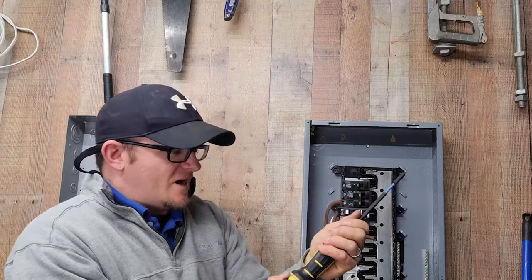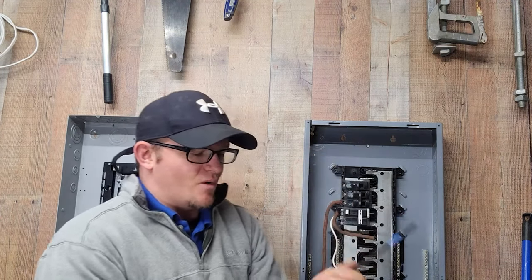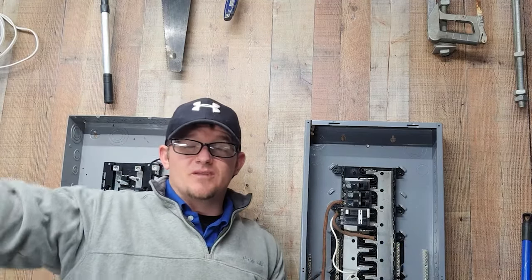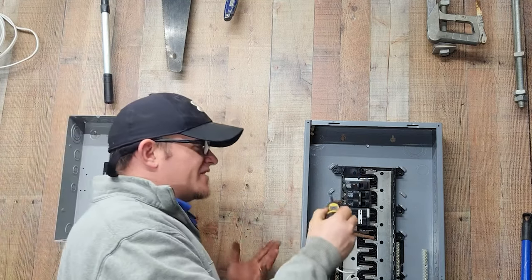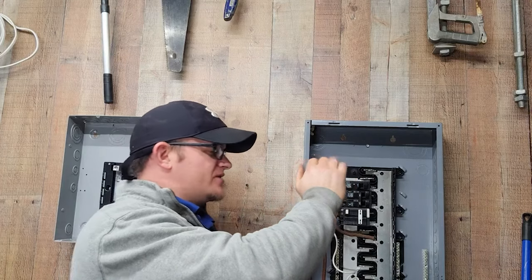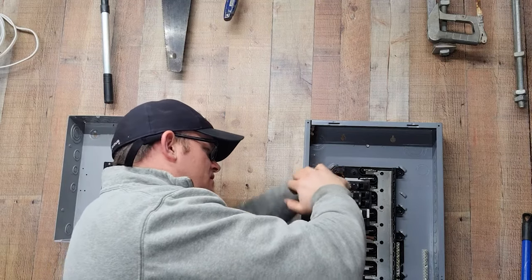Let's jump up to 55. Love it. 55. Let's go all the way up to 60. So this thing's maxed out at 60 pounds. And after this point, my torque wrench can pick up. So this dials me up to where I don't have a gap. See, before, we had a gap where it went from 40, and then the inch pounds on my wrenches goes down to 60. So this is 60. This gets me past the gap.